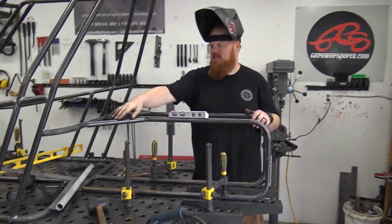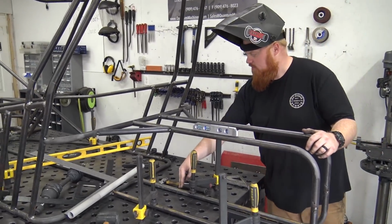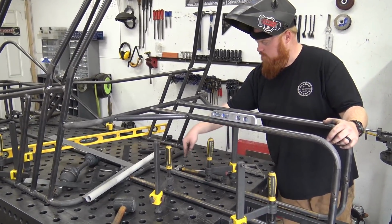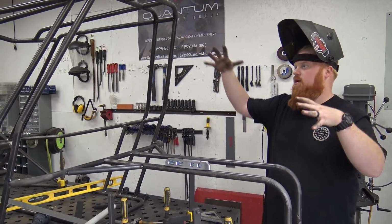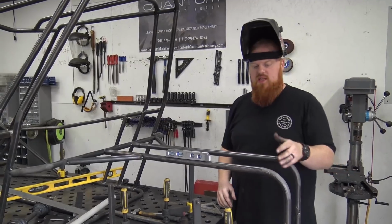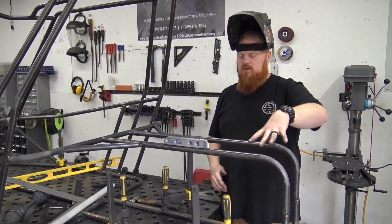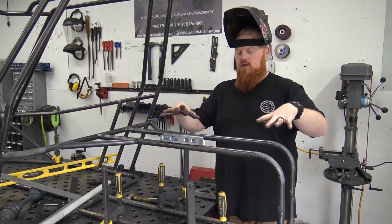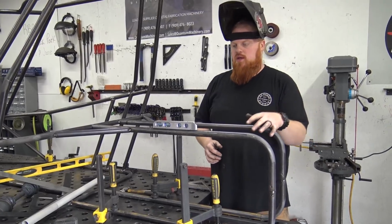So we got this braced up with some tubes I notched at 45, and we're gonna do the same thing down here, but put them on longer 45s. That's just gonna brace up this whole area. And you gotta think this area is also gonna be braced up in the upper region. We need to get some tubes notched to keep this at the width we want it. We'll probably put some type of X tube back here or something, I don't know.